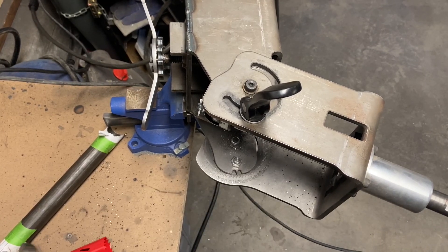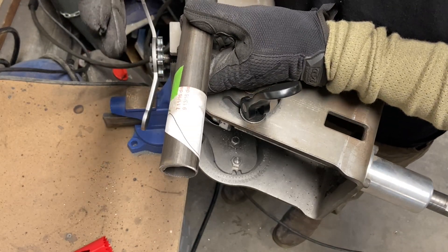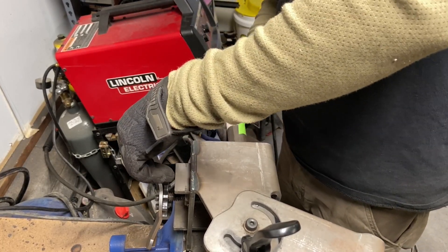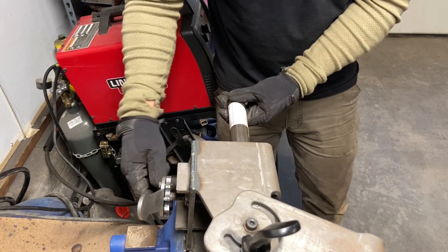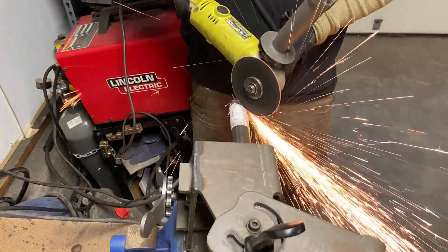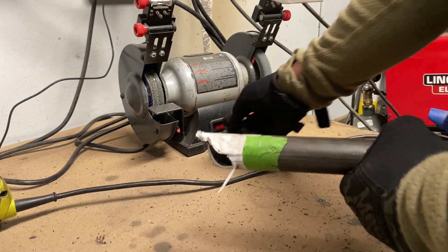Clear out the hole cut and move to the next piece — this is a 50.3 degree cut, which is a pretty aggressive angle. You can take your angle grinder and cut off the excess to stop interference. Something I love about the Versa Notcher is that you can put your tube in the opposite side, lock it in, and it works as an awesome tube clamp for making those cuts where you need to clean up a corner before your hole saw cut. You can clean your pieces up with the wrapper still on so you can follow the exact cut line.